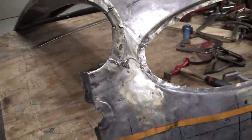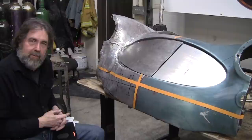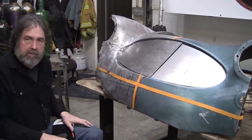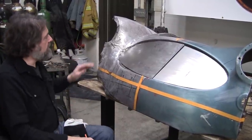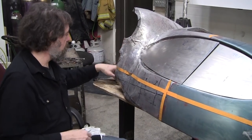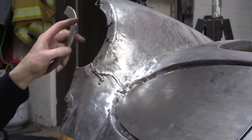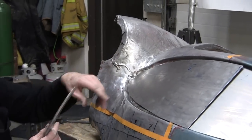Fini! Sweet. Fini. We got all the welding done that we wanted to do on that section, and we also did a little bit of smoothing. I'm hoping we'll do a little bit more smoothing, a little shaping here. But that's solid now. We're going to grind these down. We'll work that weld. We have to get this metal half round in here and get that all aligned the way it's supposed to. We'll find the holes again and drill the holes just like they were supposed to be.